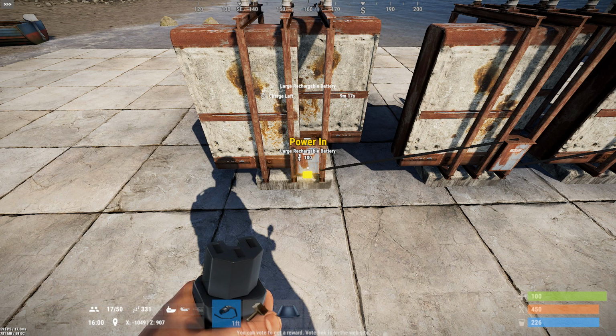If you really need to have fully charged batteries, use a bunch of input power and splitters and charge each battery independently, and then hook them up in series when you connect them to your load, so that you can have that runtime without any other blockers or switches. If it were me, I'd only use two batteries, maybe at most three if you need more than 8 hours of runtime, I guess.